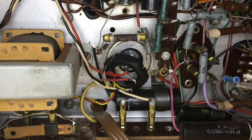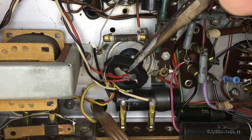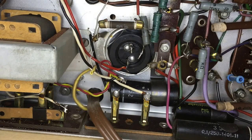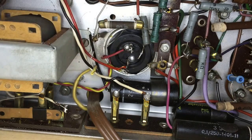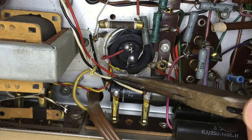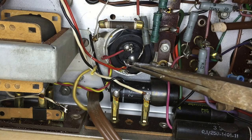Then it's just a matter of putting it back into the case and tightening the nut on the inside. Don't forget that on the outside of the chassis there's an insulation — this can does not touch the case, so beware that you leave the insulation in place. Then solder in the connections to the two pins. It's not particularly important which ones you do here because both capacitors are in fact the same value; otherwise you'd have to remember which capacitor goes to which contact.